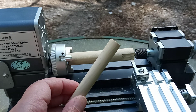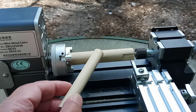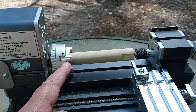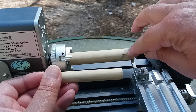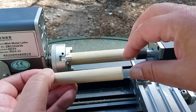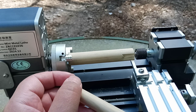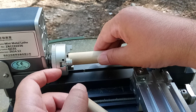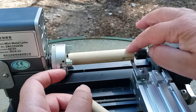This is the size of wood supplied with the lathe. And in order to fit the bigger wood I bought by mistake, I had to reverse the lathe chuck jaws. That was an interesting operation in itself. But what I've got to do now is to turn probably about an inch, or half an inch, of this down to this diameter, so that I can then reverse it and mount it in the chuck the way it should be mounted. Because the chuck jaws like this do not really afford a particularly great grip — there's not that much holding it here, so I have to use the tailstock to hold the work.